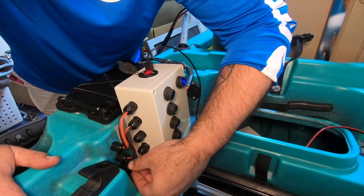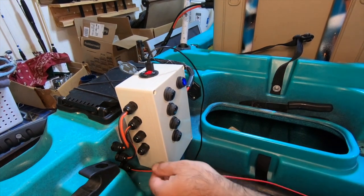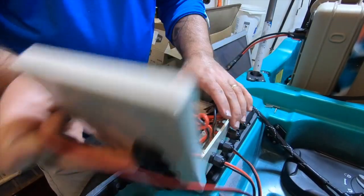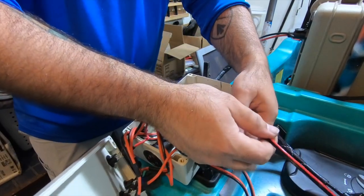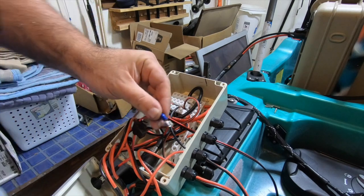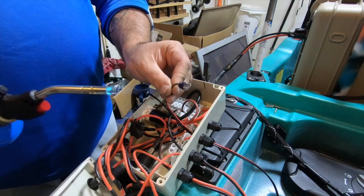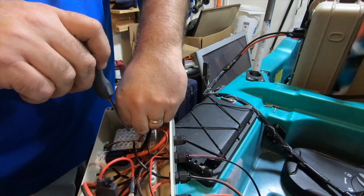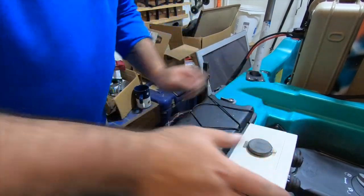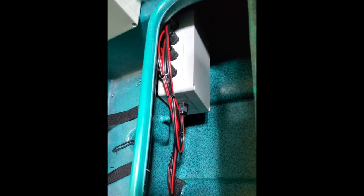All that's left is to connect the junction box to the switching box. These holes are left over from our previous build — I couldn't include footwell lights in that video because I was still waiting on parts. Feed your main wire up through the hole and pull through enough slack to do the work. I secure my switching box to the hull using heavy-duty Velcro — it holds securely but lets me remove the box when I need to work on it. Feed the line into the designated gland on the switching box, connect the red wire to the appropriate switch and the black wire to the grounding bus. The red wire requires a quick connector — I heat-shrink those, so you'll still need a heat gun. I just made do with a blowtorch. Button everything back up, reconnect the power from the accessory battery, and do your cable discipline — I secured mine to the wall with double-sided tape.